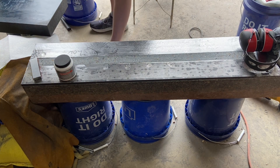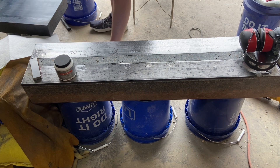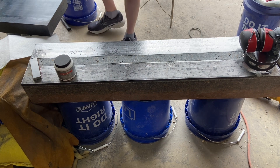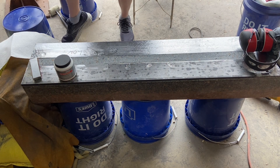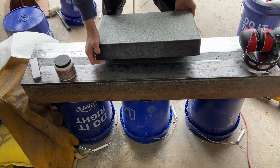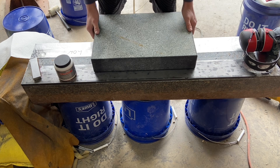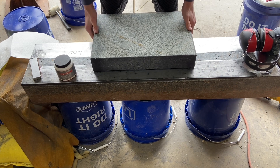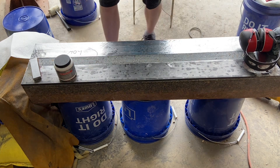I'm not super confident how much dye I should really be putting on the plate. I'm trying to just get a thin layer — maybe a couple of drops — and then use it four or five times before adding another drop or two of the Prussian blue. But to be honest, that's mostly guesswork.